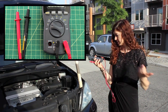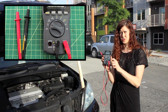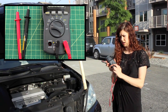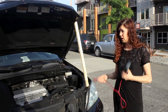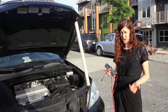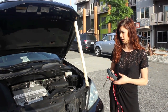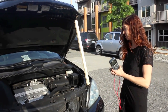You want the red lead in the probe slot marked with a V. And since we're using DC voltage, I want to make sure that I turn the voltage measurement to the V and then leave it on the dashed line. I'll make a comment about car batteries — they're low voltage, so it's not likely to shock you, but it's high amperage or high current, so it does actually get dangerous if you don't know what you're doing. Just be careful.